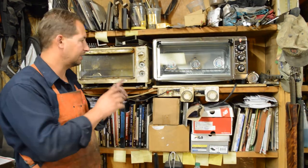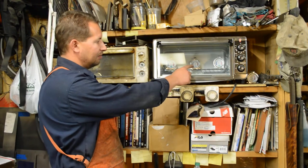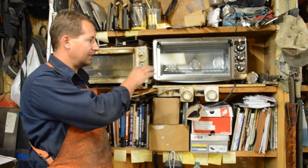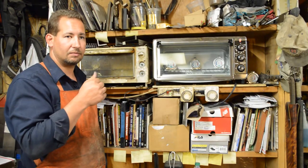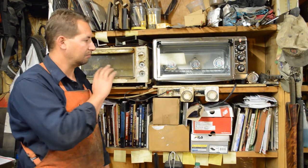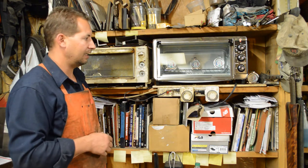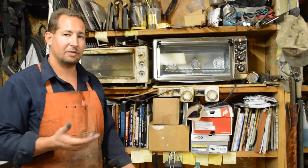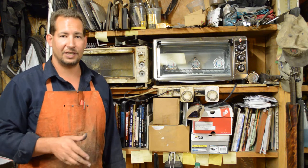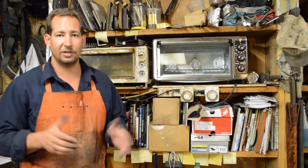When you buy a toaster — whether it's a $5 flea market toaster or a $70 brand new one from Walmart — pick up some oven thermometers, about $5 a piece. Buy two or three of those oven thermometers, mark them so you know they go back in the position in the oven where they're supposed to be. Set your toaster according to the edge deformation and how you want the edge to fail, then leave it set and mark it just for that steel type. I've been through about six toasters, which is probably why I decided to spend $70 on a brand spanking new one — maybe this one will last a little bit longer. Anyway, I hope you enjoyed the video, hope the new camera and mic turn out nicer, and we'll see you next time.